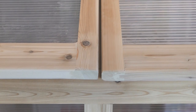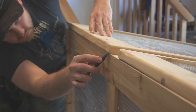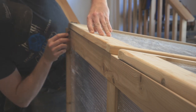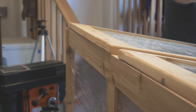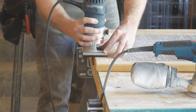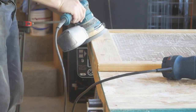After a little sand-down and mock assembly, I found a bit of a problem — something is out of square. Here's how to correct that: line up the two sides and front of the panel to the greenhouse frame, moving the error to the back. Using a pen, trace it out — here it tapers from about 3/16 of an inch to nothing. Then, using my temporary work table as a straight edge, I'll index that line and use my router with a flush trim bit to remove the excess. To finish it off, I'll use my random orbit to reapply the factory round-over.